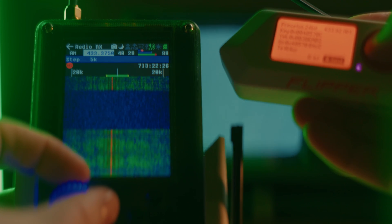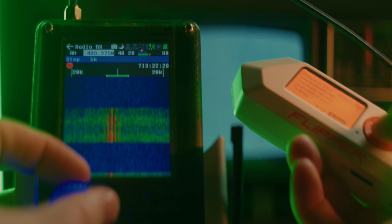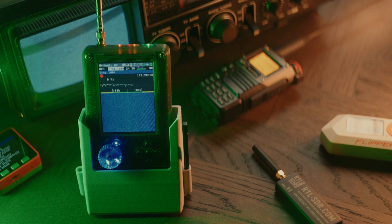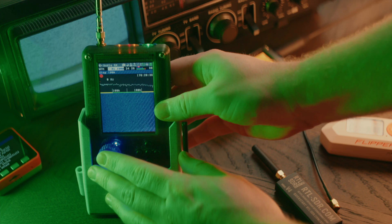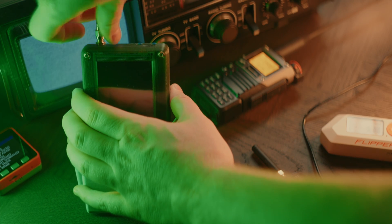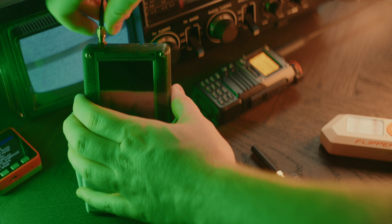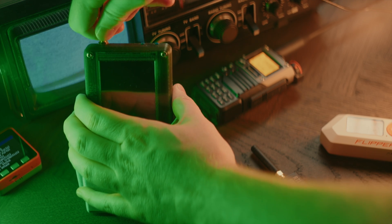And if your amp isn't broken, it is still best practice to have it turned off by default unless you actually need it. Be careful what you connect to your HackRF. Turn the HackRF off while connecting and disconnecting antennas, and if you connect outside antennas, make sure to ground them first so that you remove any static buildup.